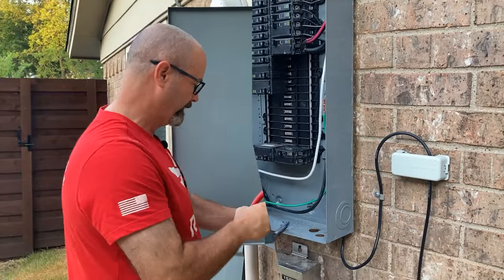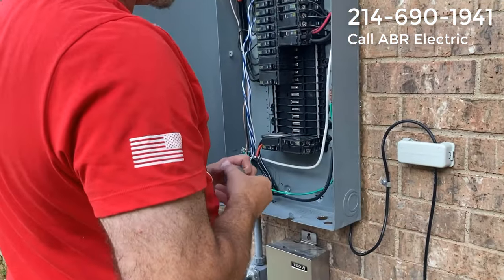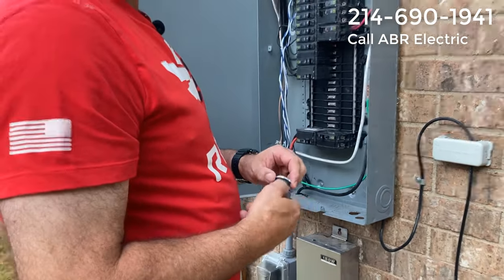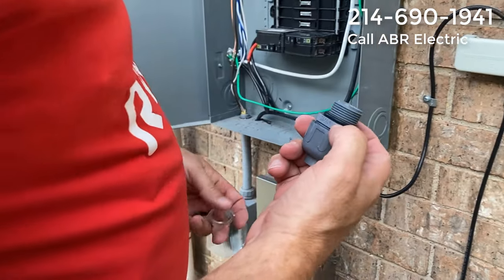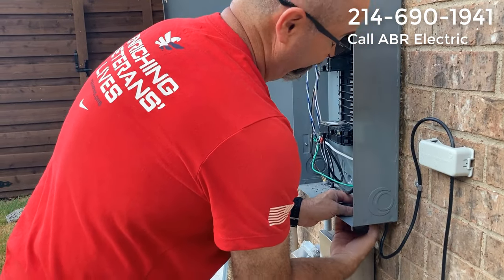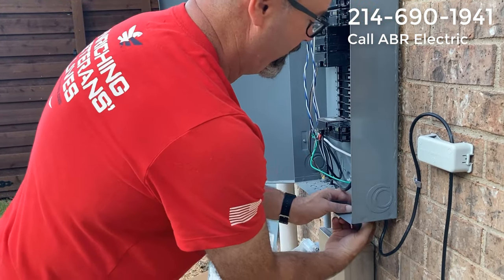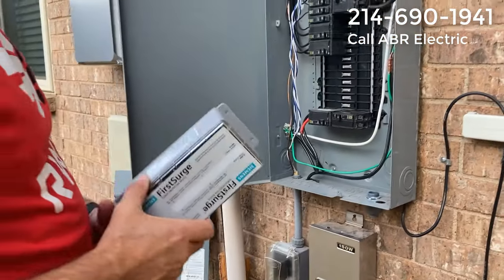Let's find a three-quarter knockout — there we go, keeping clear of the hot parts. We've got our three-quarter inch hole in the bottom of the panel. I'm going to put this three-quarter inch connector in — it's outdoor rated and has a little o-ring gasket. Some old-school guys will say 'why are you using plastic, use EMT?' — I disagree for something like this.